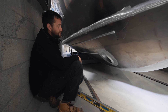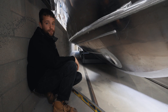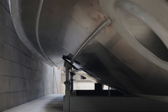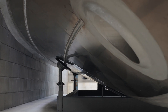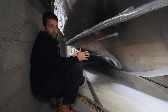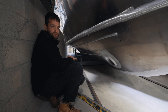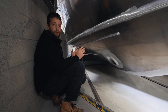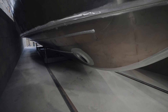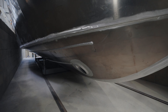You can see here this boat is further down the production line — we've got it right way up, and you can really see the amount of warp and barrel in the hull. The transom is 18 degrees, which gives us really good planing efficiency: you don't use a lot of fuel, it's easy to get on plane at a lower speed. In the bow we're over 50 degrees. The working area of the boat is station four forward — basically where you're standing at the dash — and we've got a variable dead rise of over 30 degrees through that working area, up to over 50 degrees in the very bow when you're cutting into a chop.